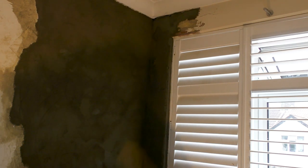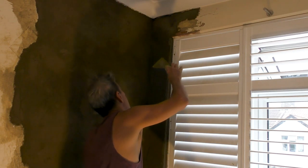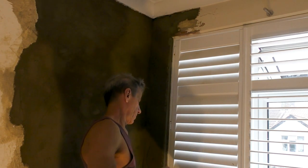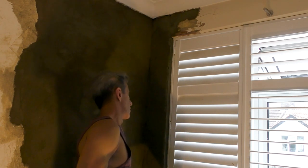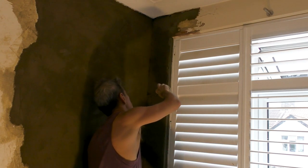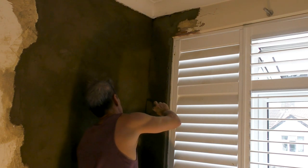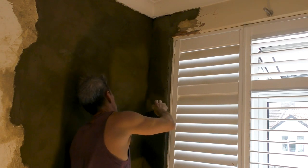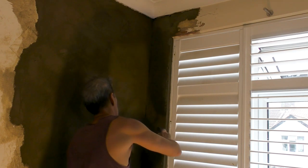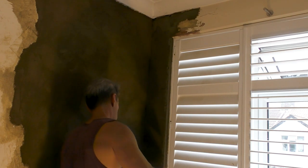Make sure your float is fairly new if not brand new. Just making sure now I get a decent bit of gear into the angle, because you want your angle to be nice and straight once the job's done. If you make a bit of a mistake with bonding plaster you can scrape it back out, but once that sand and cement's gone off it's not going anywhere - so you need to make sure you get that angle really nice.